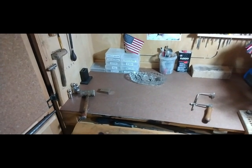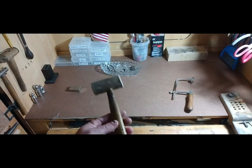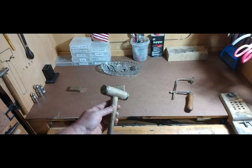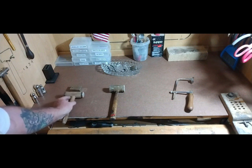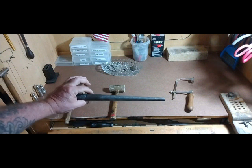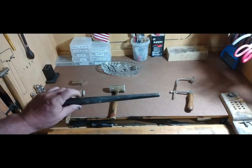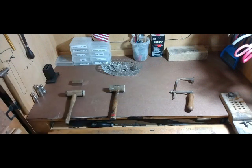You're going to need some hammers and a rawhide mallet. You're going to have to have a basic rawhide mallet. I have a bunch of different types of mallets — here's one I made that has two heads, one on each end, it's one of my favorite mallets. You can just get your basic rawhide mallet. Now, you're going to need a steel ring mandrel — here is a basic steel ring mandrel — you're going to need this for making rings, bezels, and doing all kinds of work. Get a good hard steel ring mandrel made out of good steel that'll hold up, because you're going to be pounding a lot of metal on it.